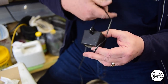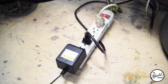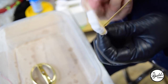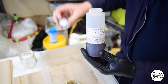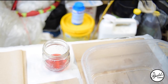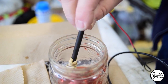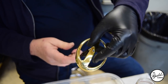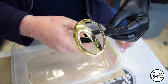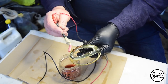The coating on it was chrome originally. What we had to do is start with a very coarse sandpaper to get the remaining finish off, and then progressively work up through finer and finer grits of sandpaper until finishing up with 3000 grit, and then metal polish.